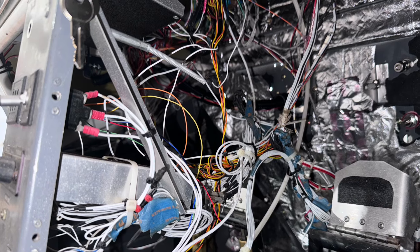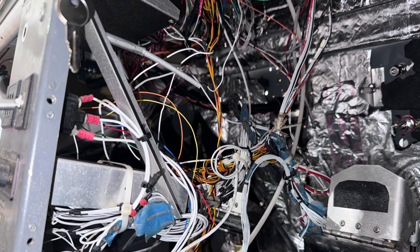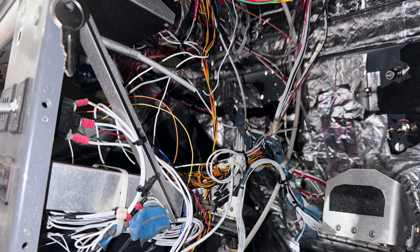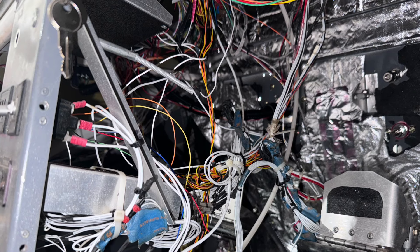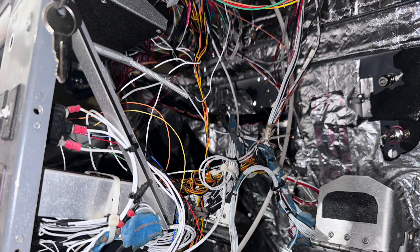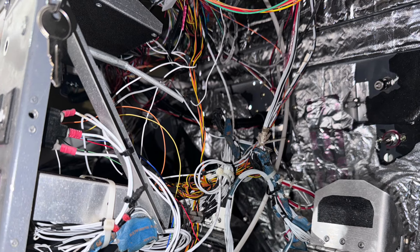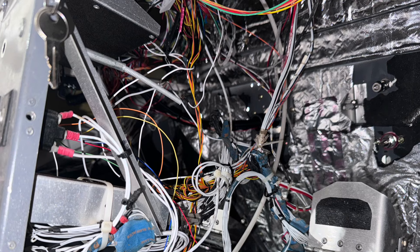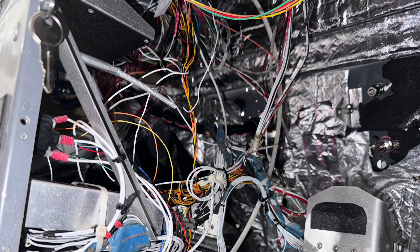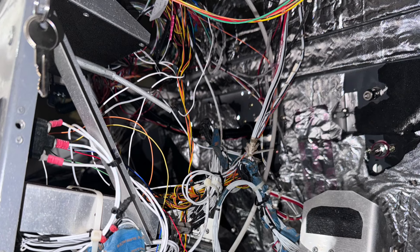We all have different wiring techniques. I personally don't like it where you just wire from here to there with no organization. I like it all to be organized and follow certain patterns. Getting in there and having our system on top of an existing system is hard. So we refuse to do that — we say this is the airframe system, we'll leave that alone, and we do our own system. We leave a 30-amp fuse with an output and say you can do whatever you want after this. But our system is organized. That way we don't have to analyze every single wire in the whole airplane — we don't care as long as it's wired after the 30-amp fuse to protect the engine.